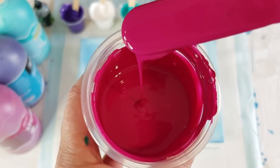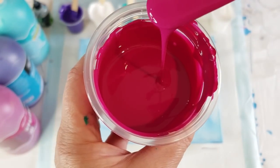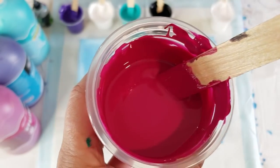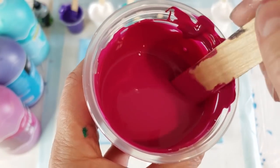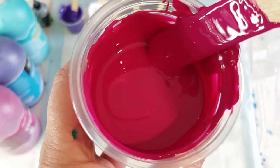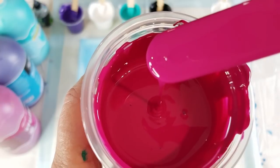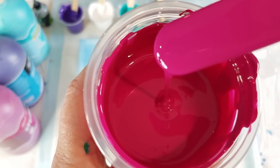It's magenta. The most important thing you need to look for: go around like that and the trace needs to sit on top for just under three seconds. One, two, three — it's gone. So if it's sticking around on top for longer than that it's too thick, and if it's gone in one second or so it's too thin.